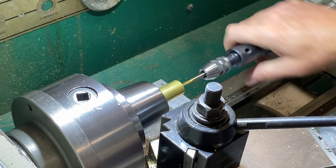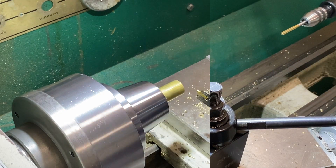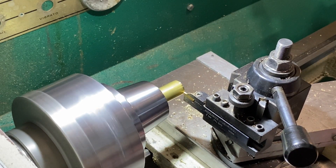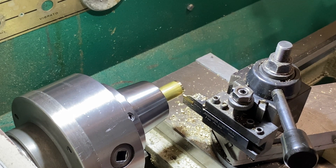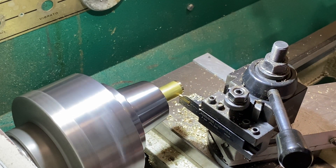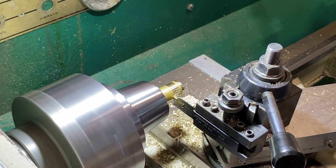There I'm going in with a plug tap so I can get down to the bottom of that hole. Now I come in and put the detail in. With a cutoff tool, I'll come in 30 thousandths and then walk it over 125 thou. Then locate off the distance of the cutter, come down another 125 thou and come in 30 and then walk over. That gives me that raised edge that you saw in the design.